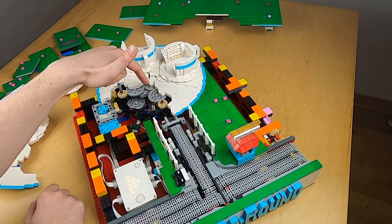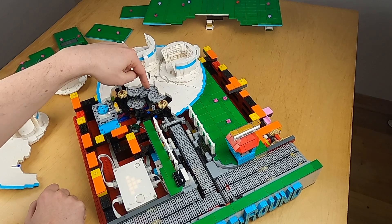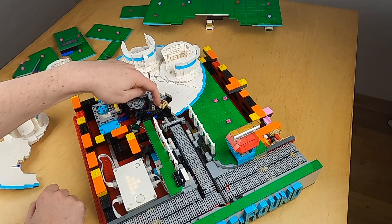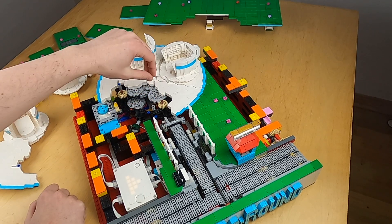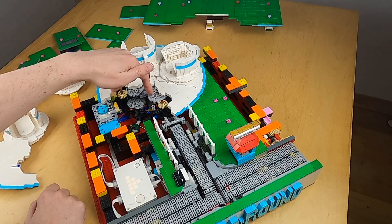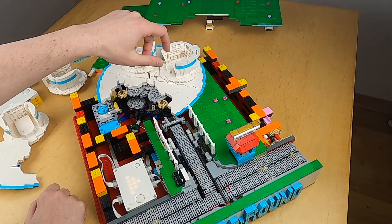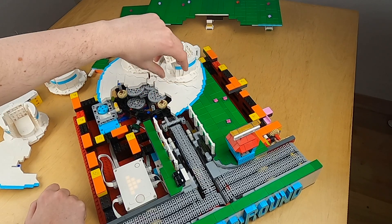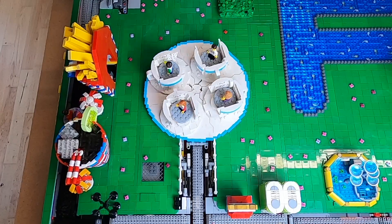So I can adjust that, but it's typically fixed when we are turning. Which means I have a 40-tooth gear here, 40 here, and these are 20-tooth gears — meaning that this will turn twice for every time this one turns once. So in total you will see that this actually gives us this motion of the cups that are turning counterclockwise as we are running around with the module.